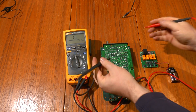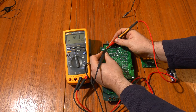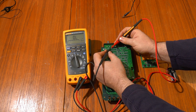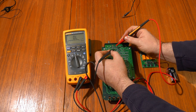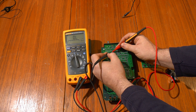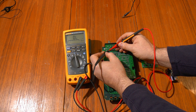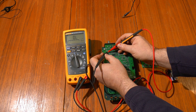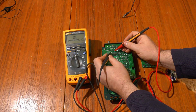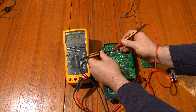All I need to do is test against the middle set of contacts on each relay. So I can go for the middle point. I'll continue on the right there, so I should have the same on there. I can do the same on these. Let's switch the other way. Oh look at that — I'll come back to that one in a second. And there's one more relay here. This top middle one — we've actually got continuity here between the two opposite contacts.